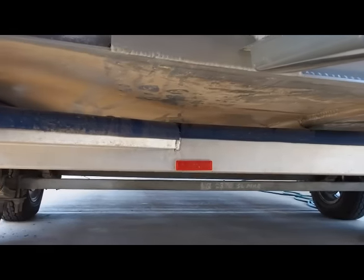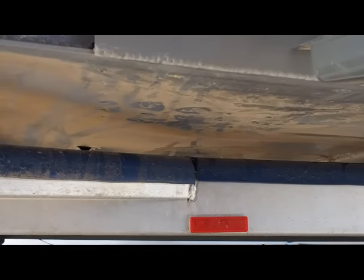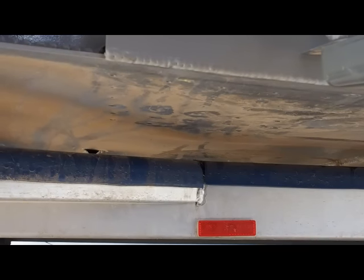The other thing to look for are obstructions under your boat. I have my transducer mounted straight behind my live bait tank — it's a self-plumbed live bait tank, so I have drilled holes in the bottom of the hull. These can also create some form of interference in and around the transducer which can affect your read at speed. I'm fairly lucky in this case and still get a good read at speed with this GT51, but things like that can create interference.